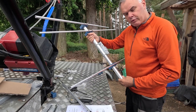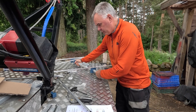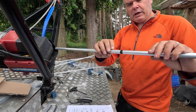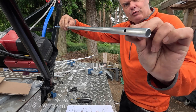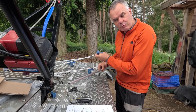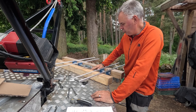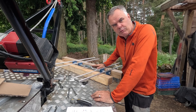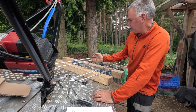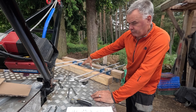I'm at the stage now where I've got three of the four elements on — they're just loosely attached to the boom because I need to make sure they're all in the same plane later on. For the last one I've just cut the cable tie, and again remembering that the larger holes go to the top. Get the clamps on, get that one tightened up, and then we'll get it levelled. That's the four inner lengths of tube attached to the main beam. What I want to do now is make sure they're all sitting in the same plane — that will look nicer and make sure the antenna works a little bit better. I also want to make sure they're at right angles, perpendicular to the mast plate, although that can be adjusted later.